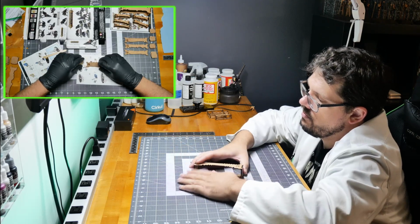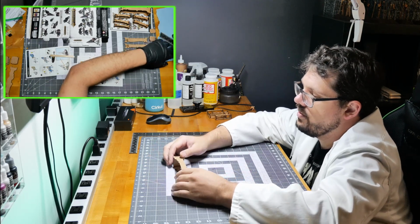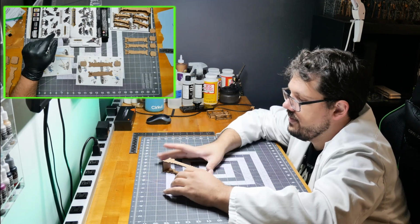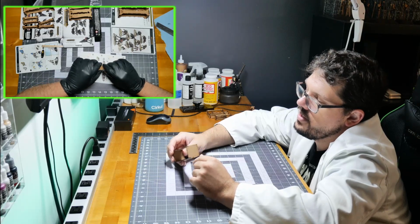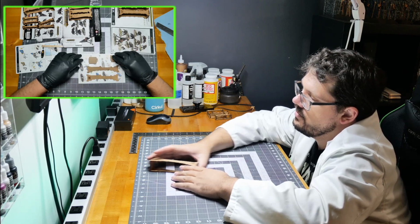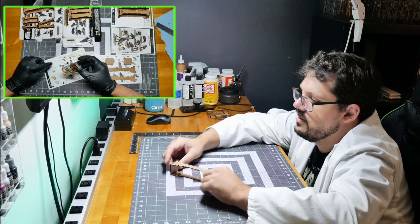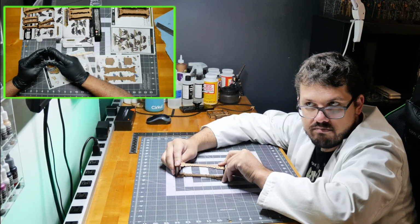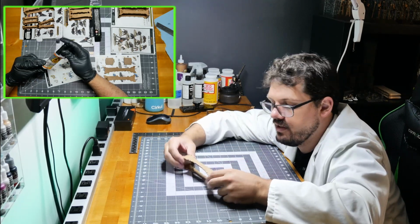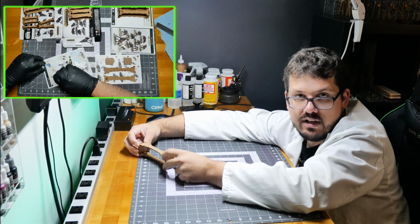same shape. So I'll run this through the hot wire, and then I'll punch out, basically the whole thing is we're going to cut a box of foam that fits in here perfectly, square to the end here, and we run it through the edge, punch it out, flip it to the next side, run it through, cut it off, and it'll be easy to make sure it's square, because I should just be able to hold the ends, basically. These ends on all of them have a little chunk where you can just hold them in place to make sure that it's even.